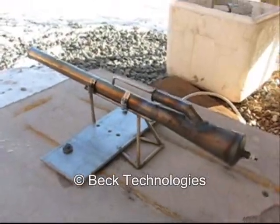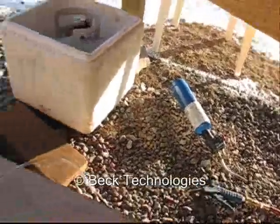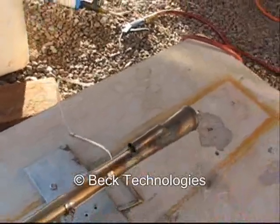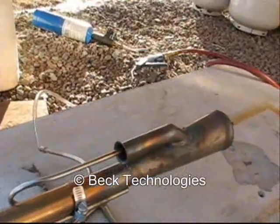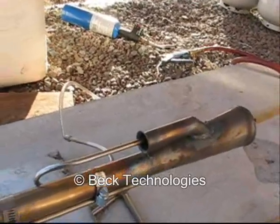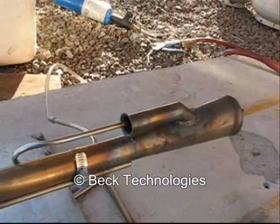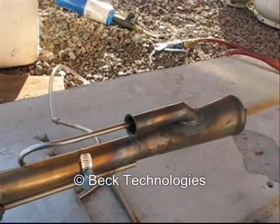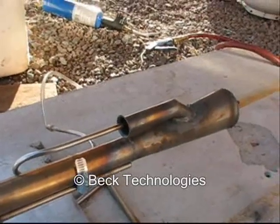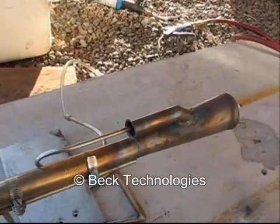When I'm going to start it, I'm going to have the little propane torch sticking in the intake a little bit. I'm just going to turn on the fuel a little bit and that will ignite it. Once the fuel is lit, I'm going to blow a little bit of compressed air in the intake and we'll start rumbling and making some pops and bangs. It's pretty damn cold out, so it might take a few seconds to start up. But once it gets roaring, I'm just going to increase the fuel a little bit and take the compressed air away and it should keep on going. Then after it's warmed up, you can crank it up to full throttle.